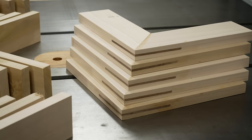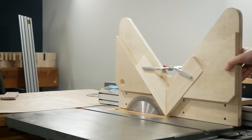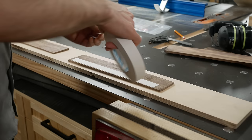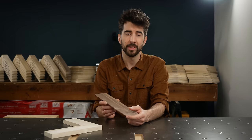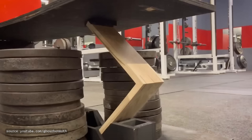Enter the spline. You can put a spline in any miter with just your table saw. If you're making lots of picture frames, I highly recommend making a jig like this one that rides on your fence, allowing you to repeatedly and accurately cut these slots. You can basically raise your blade up as high as it can go without going over. If you don't trust your planer to mill down the splines thin enough, you can double stick tape your spline material down to a flat sheet of MDF, or sneak up on the perfect fit on a table saw using feather boards to keep things consistent. Jason Hibbs of Bourbon Moth made a video about joint strength and his splined miters were the strongest in his test, so I was fully expecting this joint to blow my mind.